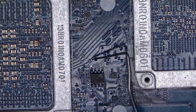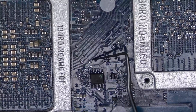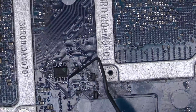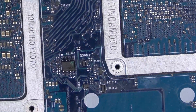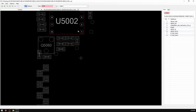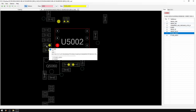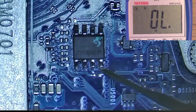Once I got that cleaned up, I also went on the back side, and there was one knocked-off capacitor for the data line between the CPU and the GPU. And a missing capacitor here, which, according to a completely different board view that I was able to find, using the power of brain deduction, I was able to deduce is a filtering capacitor for 1.8V, and we can leave it alone.